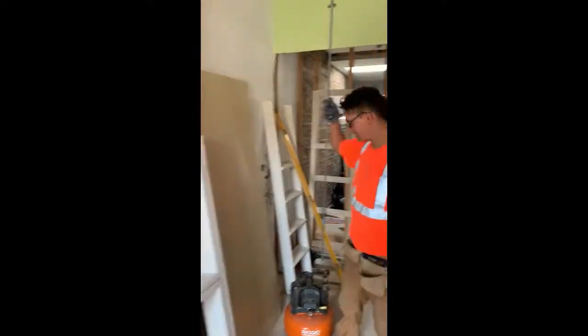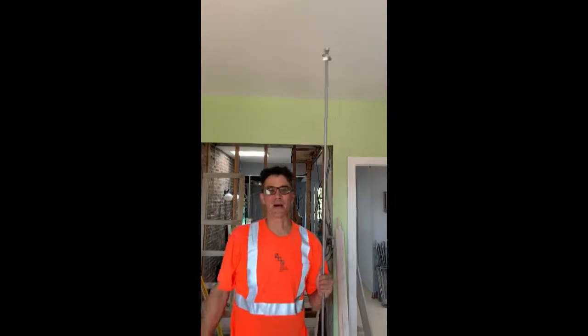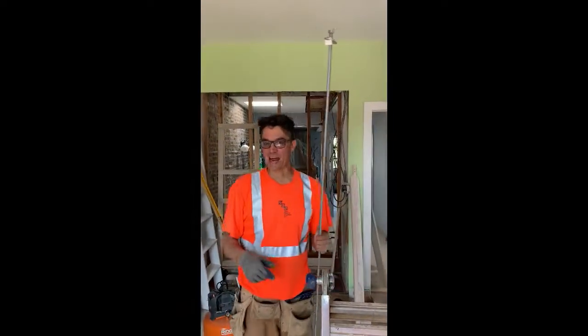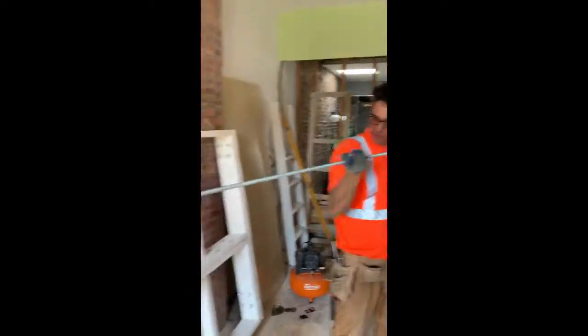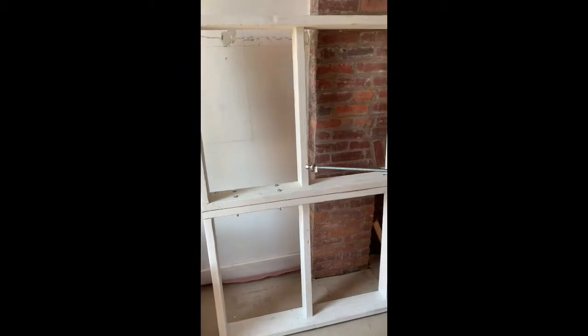It's a half inch threaded rod with a big bolt. We're going to shoot a video today and give you kind of a blow-by-blow as this thing comes together. We're going to install it all today in an afternoon. We've got our level lines and our glue on the wall. We're going to attach it to the studs. And we've already connected the pieces of framing together.